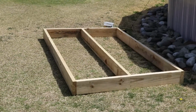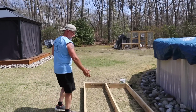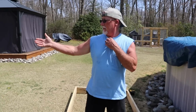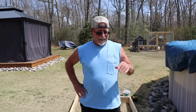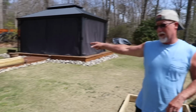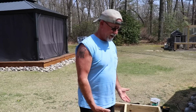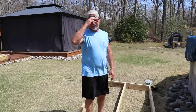But anyway, I have the size of it that I want right here. Now you might think that I was going to put 2, one here and here, but I didn't order quite enough 2x6s for that. Weren't you just saying earlier that you thought you ordered too much? No, not of them. I'm talking about the 2x4s and maybe not the 1x6s. But because there's going to be little foot traffic on this, it's not like that deck there or that deck. There might be 1 or 2 people standing on here, and because I'm using 2-inch thick wood, a 2-foot center spacing is fine for this.